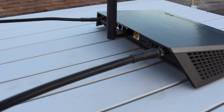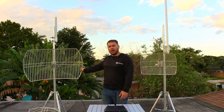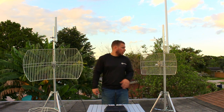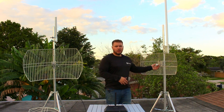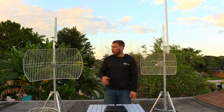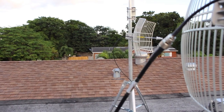In this first scenario I decided to go with two parabolics, keeping the middle antenna in — this keeps some signal inside the house or apartment while transmitting signals out to very specific points, like a barn or another access point. Over here I've plugged into the 24dBi 2.4GHz parabolic antenna, and on my left I've got a 27dBi 5GHz parabolic antenna — very directional, about 7–8 degrees radiation pattern on the 5GHz and 6 degrees on the 2.4GHz. Very focused beam width, so you have to be right on point when aiming, but once you're on, you've got the best possible connection and throughput.